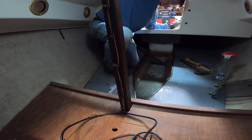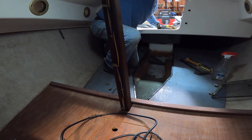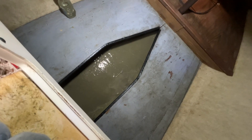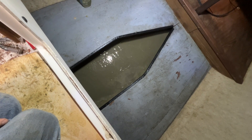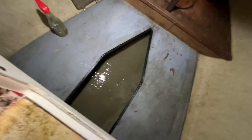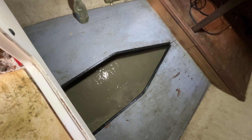Ultimately I'm trying to put the same amount of weight in as I took out, but adding more weight as lead and less as concrete, then lowering the concrete level in the footwell an inch or so. I've done this before on another boat — it's been a long time — but it works well and actually makes the performance of the boat better. I ended up putting in 50, 60, 70, 80 — I ended up putting 105 pounds of lead in there, and then less concrete to get it back to the same approximate weight. The majority of the lead is somewhat low in it, so that should help performance a bit.